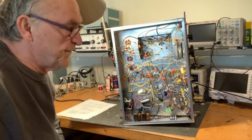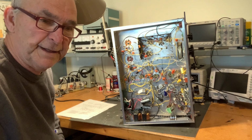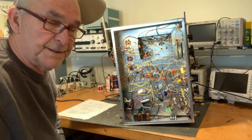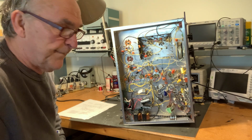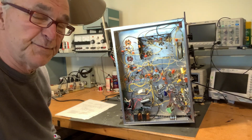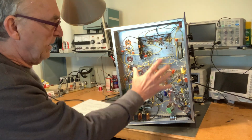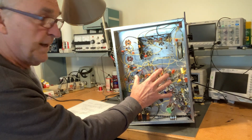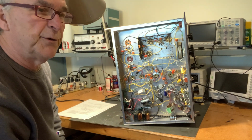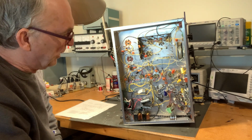As an example, when Ted Crosby was testing out an HBR-13 that Alex Stewart built, Alex wasn't able to get the IF amplifiers to oscillate, meaning to go into regeneration. And that was a feature of all the HBRs, that it regenerates. Ted Crosby thought it was due to this RF front end section being placed in the middle of the chassis. He wanted to do that so the dial would be right in the middle and look really nice. But they had trouble getting the mixer and the IF amplifiers to oscillate, to go into regeneration.